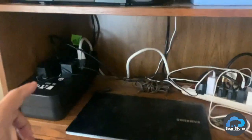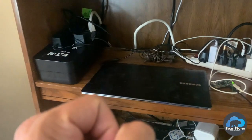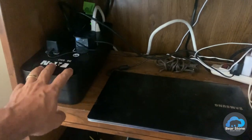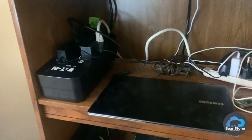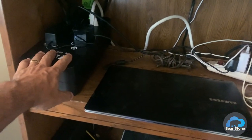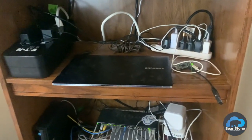The idea behind it is if we lose power, the Powerwall kicks in. So there is a brief momentary flip, and then the unit will kick in. The UPS will cover that. It just needs to cover it for, you know, a minute, maybe less, because the Powerwall transfer is super fast. Then the Powerwall will reinstate power across the home, and then the UPS will think it's back on grid power. So all the devices, there won't be a momentary blip. Everything will be fine. There won't be anything to reset. Everything should just be smooth.